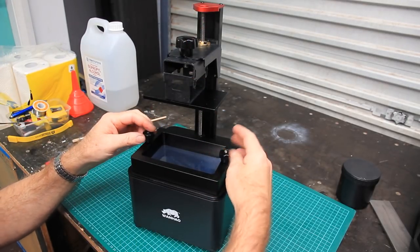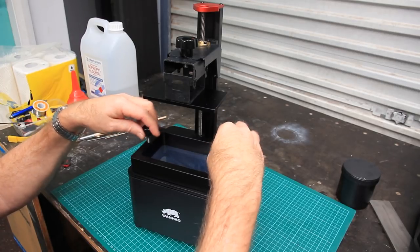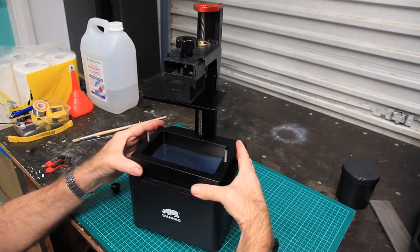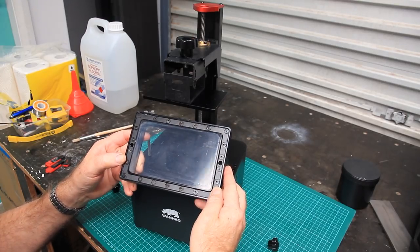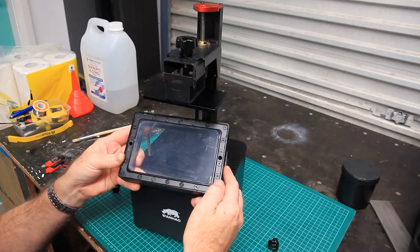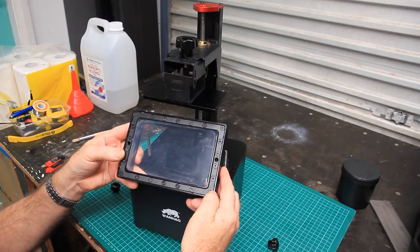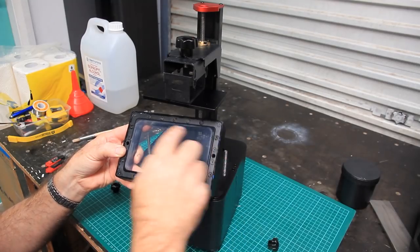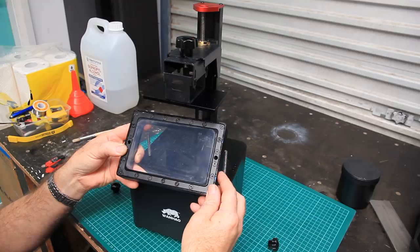Down here is the resin vat, which attaches with these two screws. How thrilling, watching me unscrew these thumb screws, and the resin vat comes off. The interesting thing about the resin vat is that it has this plastic film, which you can hear is tight as a drum skin. Now, I was worried about replacing this FEP film, but it is actually quite simple to do, provided you take some time and just do it gradually. There's a lot of screws in here, but there's a little video on replacing this film. I'll link to that in the description.